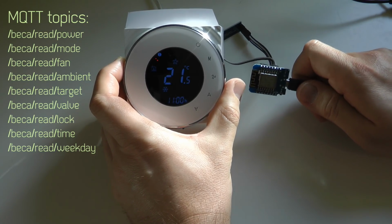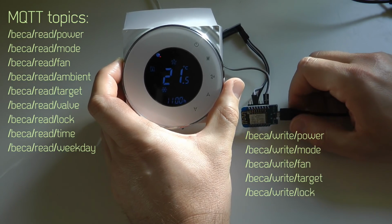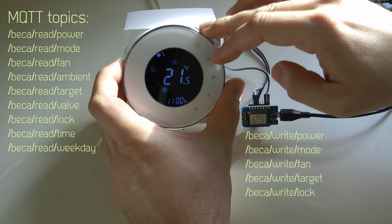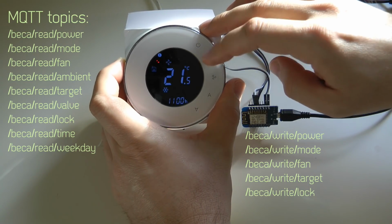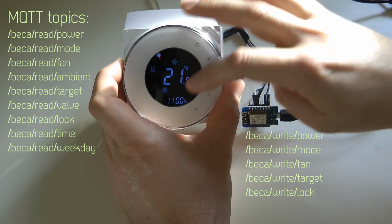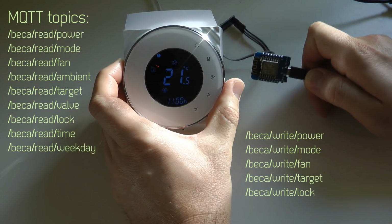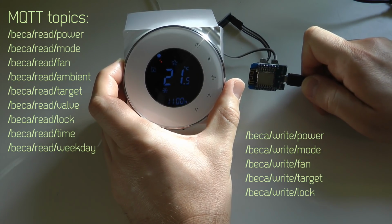The device also subscribes to a couple of MQTT topics on which you can set the different states. So you can power the device on and off, change the mode between heating, cooling and ventilation, change the fan speed, set the temperature, and lock the screen, remotely via MQTT, and I think that's pretty much it. So this sketch establishes two-way communication between the device and MQTT via different topics.